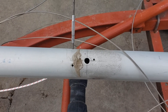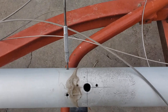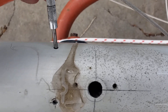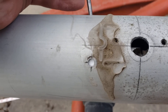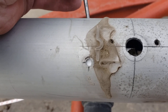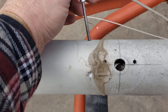I have drilled a second hole that I will fill with a rivet. I've got my machinist scribe in there and my conduit. When I pull the conduit up, you can see I can roll the conduit into place. I will drill my 3/16ths hole there, then install the rivet, and fill this hole here with another rivet. That will be one part of the conduit installed.